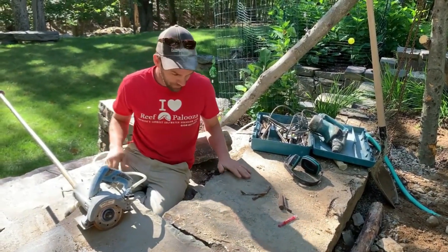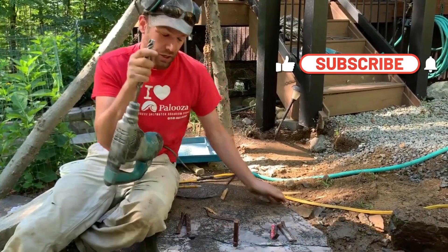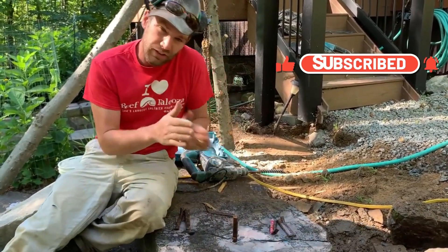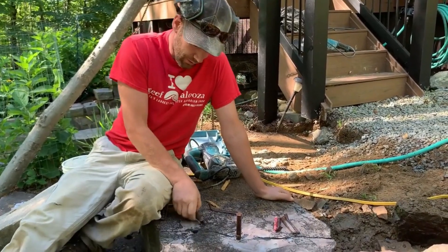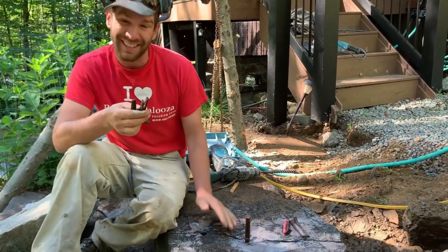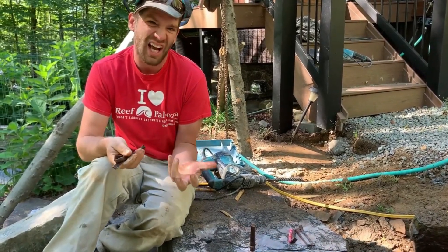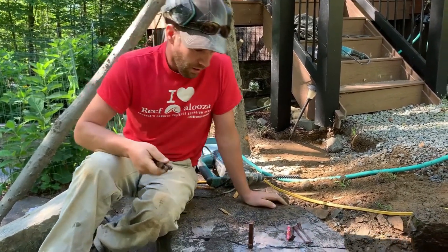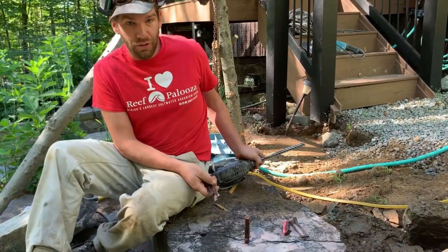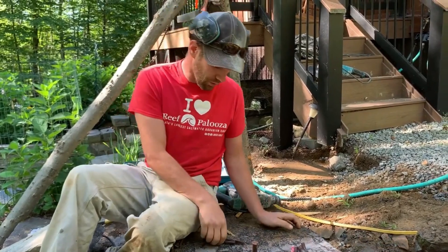We use a three-quarter inch drill bit with feather and wedges. This is granite, and even within granite there are different hardnesses. The most effective use of these wedges is in harder material — think about how glass breaks more cleanly than sandy concrete. Almost all varieties of granite work pretty well, but the harder the better. It's a pain to drill the harder stuff, but once you're in there, there's no give.